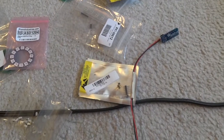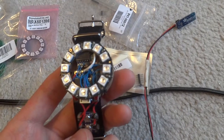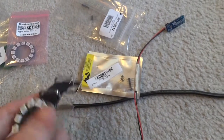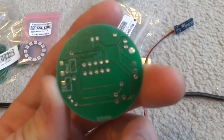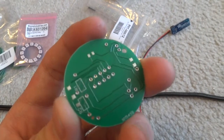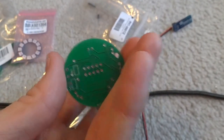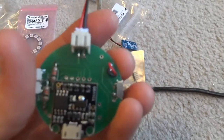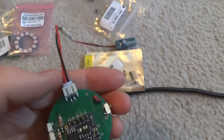Hello everybody. In a previous video I was showing this watch project that I'm doing as a prototype, and now I am working more to make it more official. I've designed a PCB board from Bay Area Circuits' program to design your own PCB board. Here is one that is halfway built — it has the battery coming into the front, the switch and two buttons on the side, the Arduino board, and the charging port.